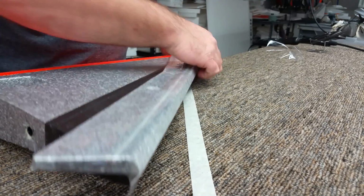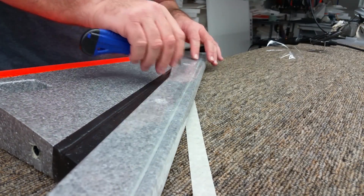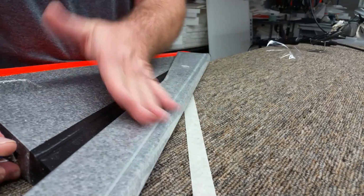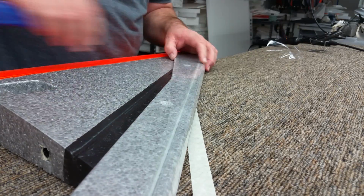The EPP Elevons aren't as clean and pretty as the wood Elevons, but they are very, very functional. They have really good performance, and they're very, very durable. If you see any bubbles that you have in there left over, you can go through with your razor or a needle and pop the bubbles a little bit and push it down.